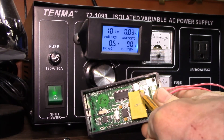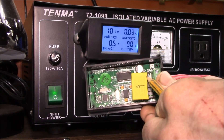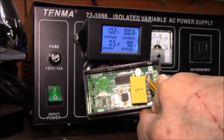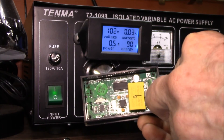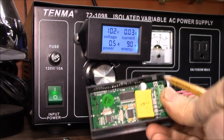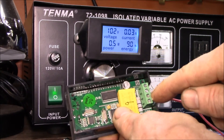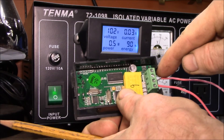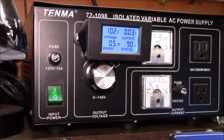The other fix is to repower the meter internally. I want to add a wire off of the input capacitor, which is the capacitive dropper power supply for the device, and run the meter's power from a separate, non-variable voltage. So I'll be adding a fifth wire: four sense wires for voltage and current on the outside, plus a fifth wire that actually powers the unit.